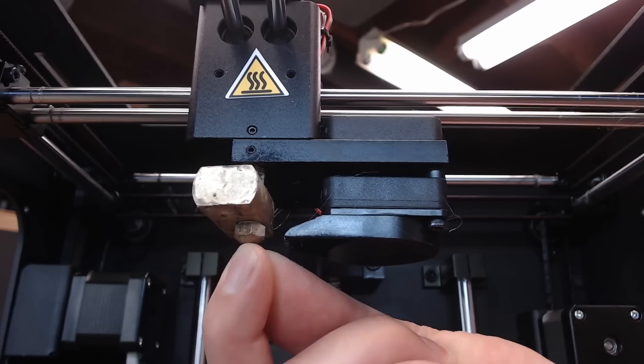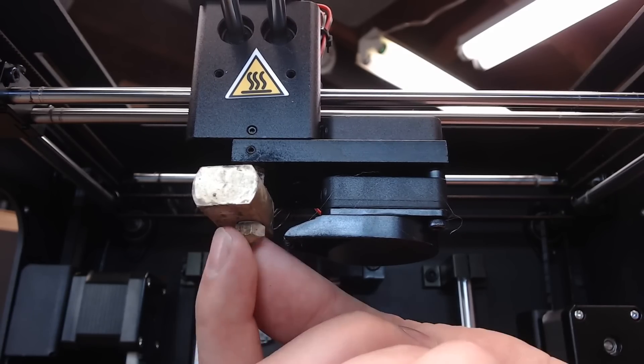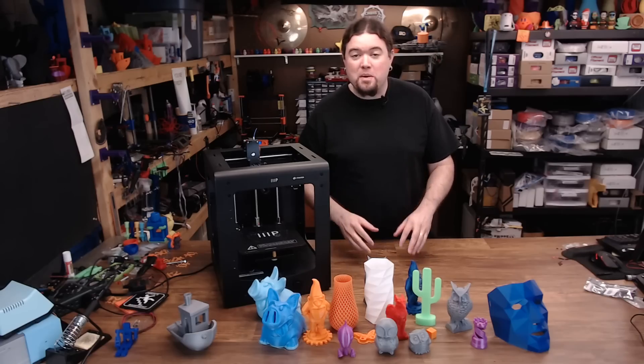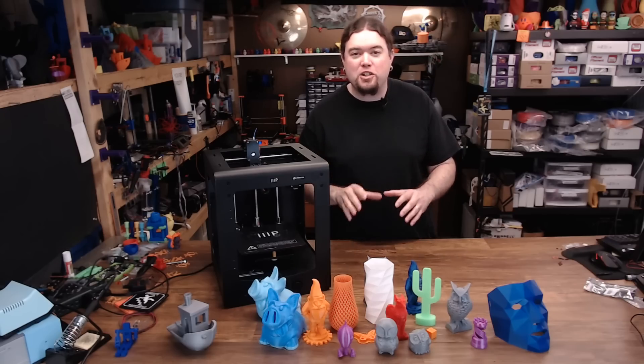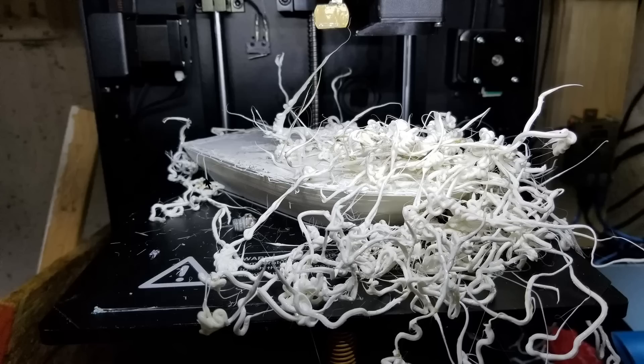The nozzle is the Mark 10 type that has a PTFE tube running all the way to the tip. This is not my favorite setup — it is pretty prone to jamming, and I've had this one taken apart several times. This is also a great place to show you one of the most fantastic fails I've ever had on a 3D printer. One of the times I was clearing a jam, I didn't get the nozzle torqued down good enough, and it fell out mid-print while printing a benchy and just started dumping whole pieces of melted filament on top of the model, not extruding at all. Pretty impressive.